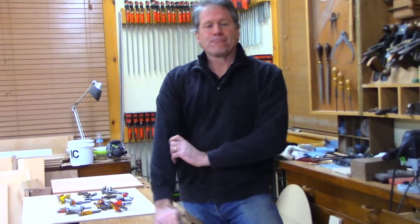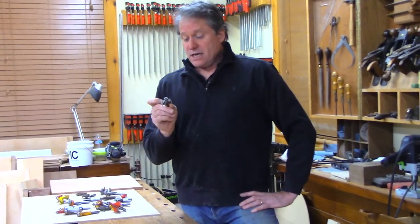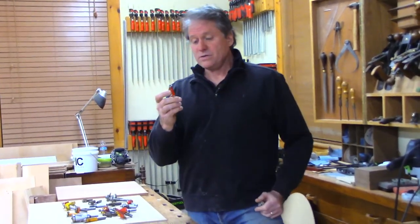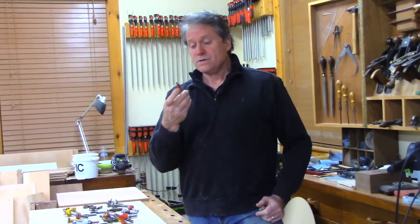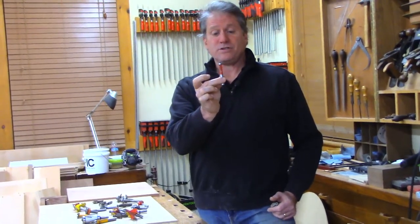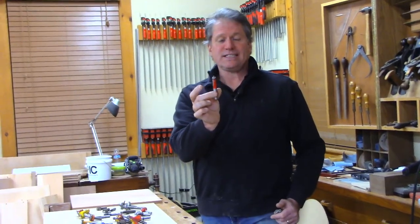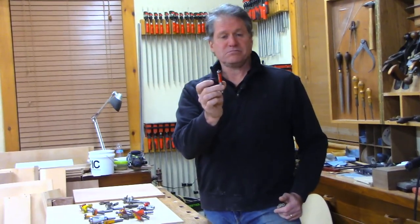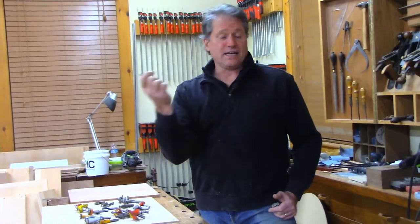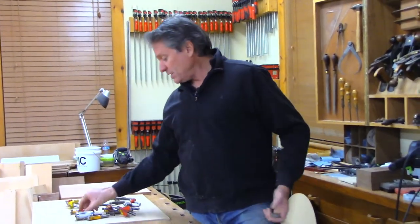Okay, Tom's asking, does sharpening the bit change the diameter of the cut? Yes, technically, subtly it does. I've often thought about that. Someone else will have to answer that. When you sharpen a flush cut bearing like that, I think they do hit more. If you hit either surface, you're going to slightly change it. I don't think it's enough to worry about. You can probably get a few sharpenings, but someone can speak to that. That's a good question. I know it has to, but you can get them sharpened. So there's probably a certain point at which that bearing no longer is giving you the intended shape.